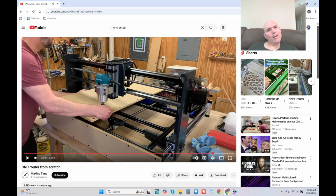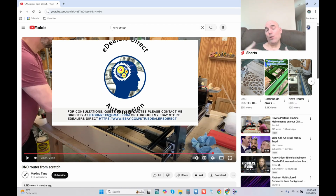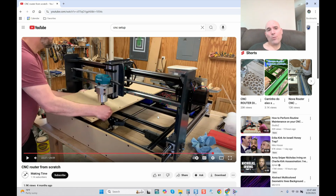What have we here? We have a wood router. What do you think a wood router is going to do? Not designed for CNC robotics use. And then we can't ground anything because we have a control box, an enclosure that is manufactured out of plastic. You have an ESP32 USB controller being used, which already has built-in instability due to the low signal voltage it uses, on top of the fact that USB in general can have all kinds of grounding issues from your PC, voltage spikes.